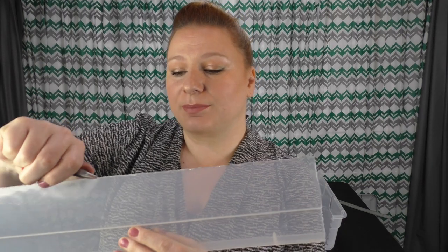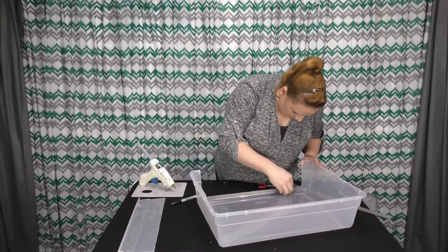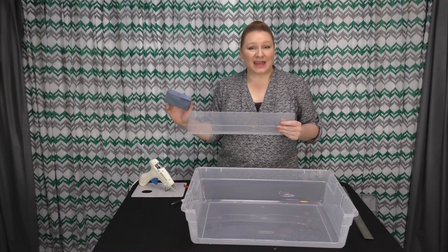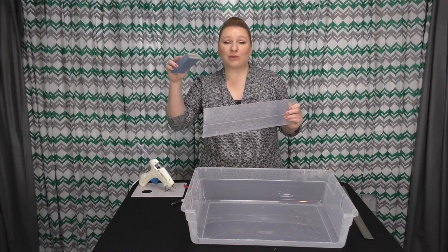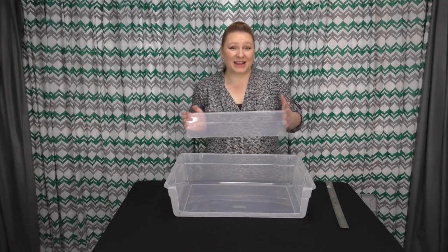Just like that. See how it's a little uneven and there are pieces sticking up? What you do is you just take a pair of pliers and pull off those extra little melted pieces. You want to peel all these off that you can on both pieces — that'll just make sanding a whole lot easier. Once you peel those pieces off go ahead and just take a sanding block to it, kind of smooth out the edges. While sanding, remember your goal is not only to get rid of the sharp pieces but we are rounding the edge. Everything's sanded, nice and smooth.